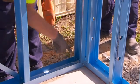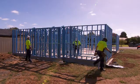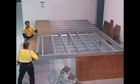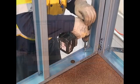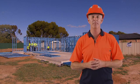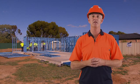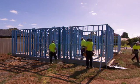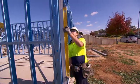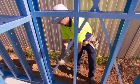For a concrete slab, drill out the holes, clean them and then insert the anchor bolts. Install the hold downs in the locations specified. For framed floor construction, self-drilling screw fasteners are used for fixing through the bottom plate into the floor joist or perimeter member. Hold downs are generally located at panel ends, brace points and jam studs, nominally at 1200 millimetre centres adjacent to the studs. After you have completed the installation, check that all hold downs are correctly located. Use a plumb bob or level and set the walls to vertical by increasing or decreasing the tension on the diagonal bracing.